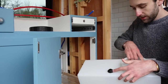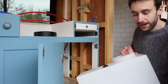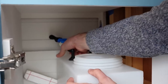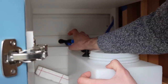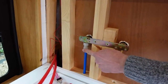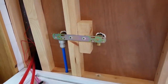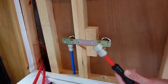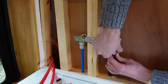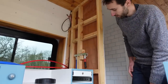We've just put another tank connector into the shower tank. We still need to add a drain and the actual shower outlet, but we haven't done those yet. On the cold feed going to the shower that's a 12mm John Guest to half-inch female BSP fitting. On the hot side — which we're not doing yet — we've just hooked up a little bit of hot pipe with a non-return valve to stop any drips coming down, and when we do connect the hot it will just go down like that. It's worked out quite a neat setup under there.